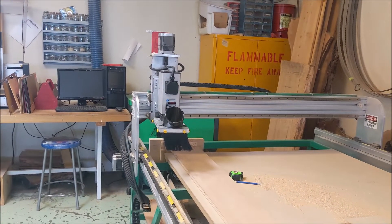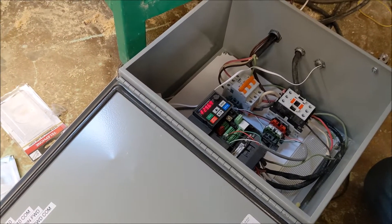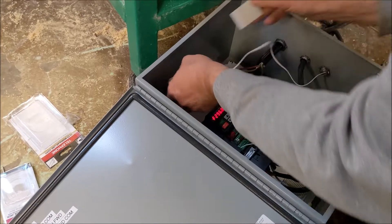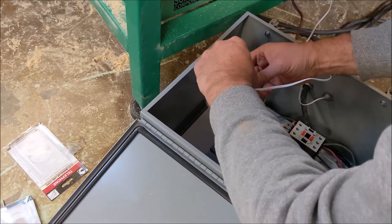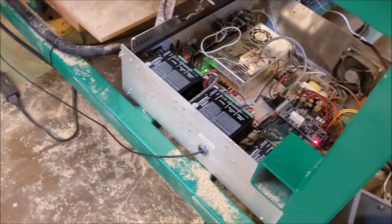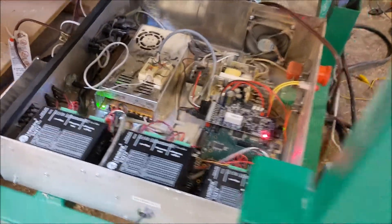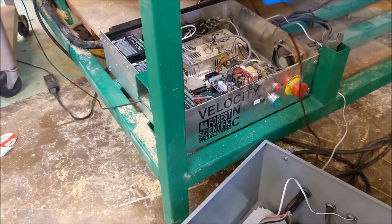So we can program speed. To get my four-conductor wire, I went ahead and used a phone cable because it's data-level — all really low current. And then to switch the main power in this box on, I put a power cord that's on the original output to the spindle, but it's wired to be on all the time, so as soon as the control comes on, it powers this up.